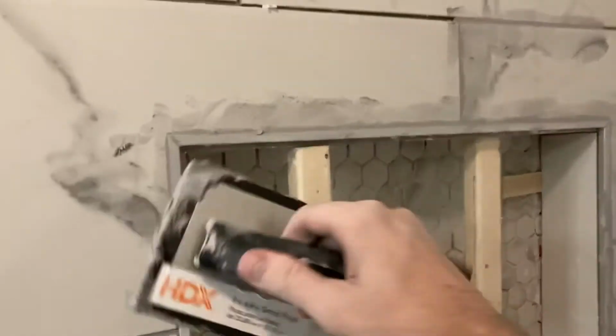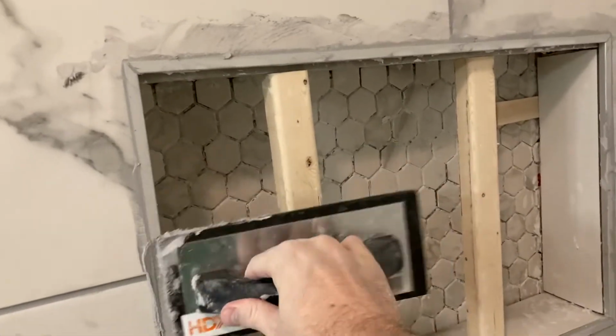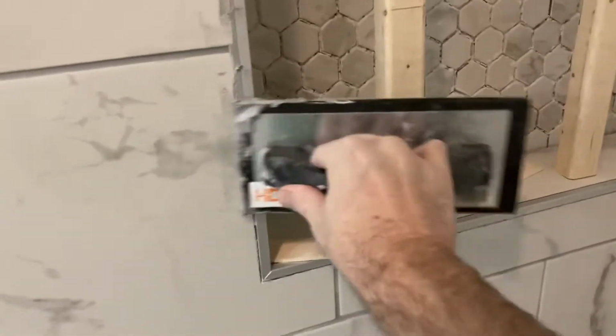Now, I do have this extra little tool here, and I'll pop links down below for all the supplies and tools that you see in the description, as always. But this thing kind of has more of an aggressive scrubber on it. It helps lift up some of that haze. And I am going to grout around the custom shower niche, the Schluter trim here.